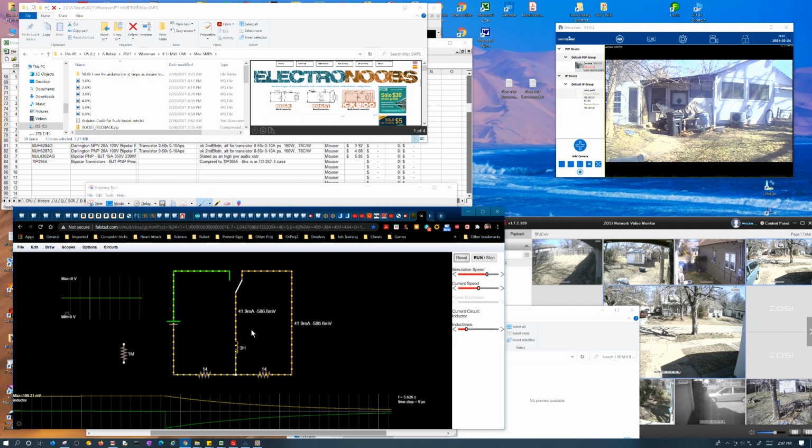So that's why you get a higher rate of current on a smaller resistance. It's actually just trying to maintain its voltage. You can look at it that way, but a smaller impedance will cause a capacitor to discharge faster, even though it's trying to maintain its voltage. I mean, it's only got so much energy to work with. But it's essentially exactly the same phenomenon we're seeing with current in an inductor.